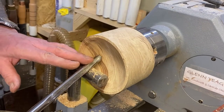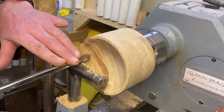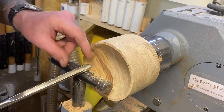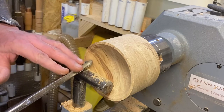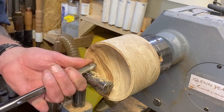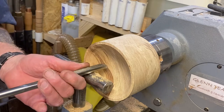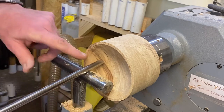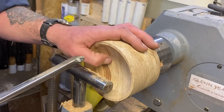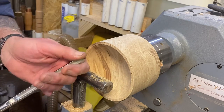When you come down to the bottom of the bowl, what new turners don't do is roll the chisel. It's not just following around — there's wrist action; you've got to roll your chisel as well. When you get to the bottom you want to roll it a little bit so you stay cutting here and follow it round. A lot of new turners will pick up the cut, do well going down, but then at the bottom that bottom wing catches — throws you over. Then you get cautious, try a pull cut, but when you come around that wing hits the side and that's the catch that really grabs you, bangs it, can break or throw your bowl off.